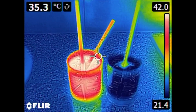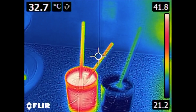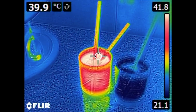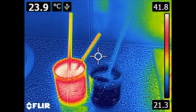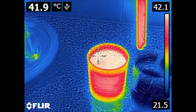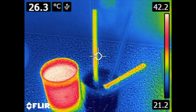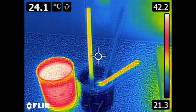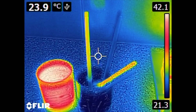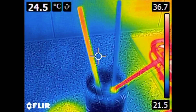And now the heat pipe back into the cold water. You can see how the water heats up a little bit around the heat pipe, and the heat pipe is already cooled down. It takes a couple of seconds and it's done. Again, the other two remain warm for a much longer time, and in the case of the steel rod it seems to have almost no heat conductivity.